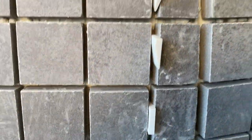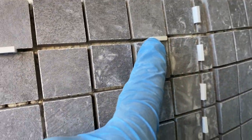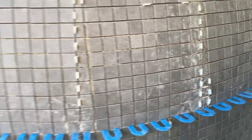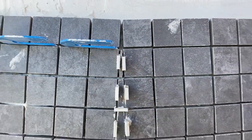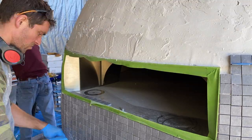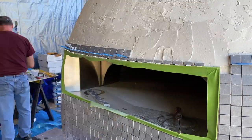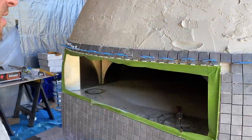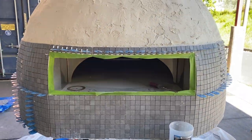Quick tip — I love these wedge shims. They are so versatile: you're able to use them vertically, horizontally, or doubled up. It's a perfect, very versatile shim that I highly suggest using if you do tile work. If you have a large opening and want to tile over the top of it, keep in mind that even if the tiles don't line up perfectly at the end, you can easily adjust them by slightly changing the distance between each tile to find a perfect center point.